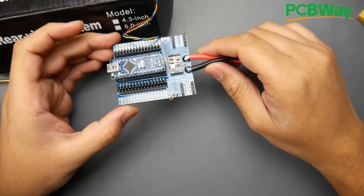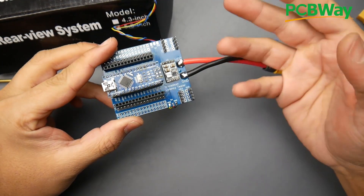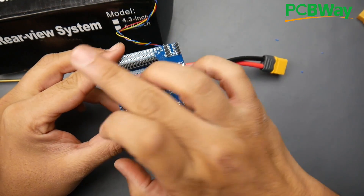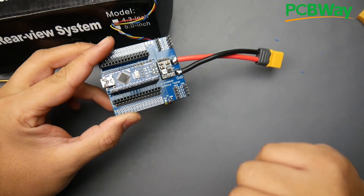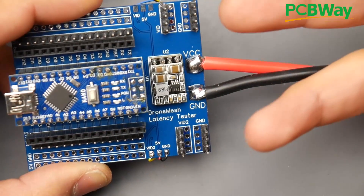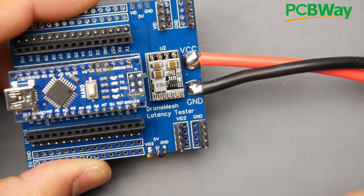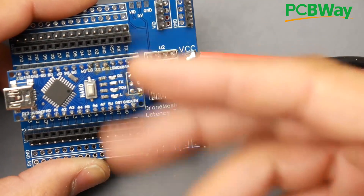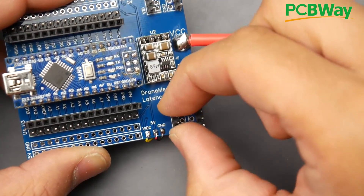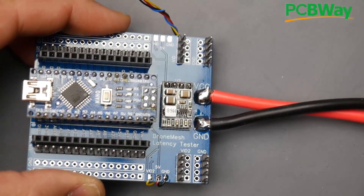Here it is complete — this is its final form currently. I'm using the Matek voltage regulator to step down the voltage from 4S down to 5 volts to power everything, including the camera and the LED. I've set up two video inputs, which allows me to provide 5 volt, ground, and video to the camera. I receive the video, which is routed to one of these pins where I can put my oscilloscope probe to test the latency of the camera.